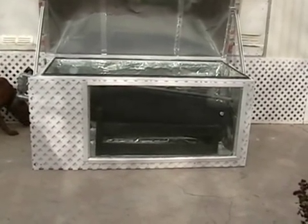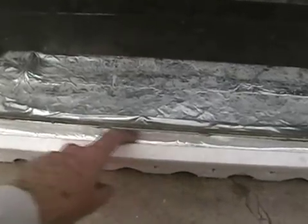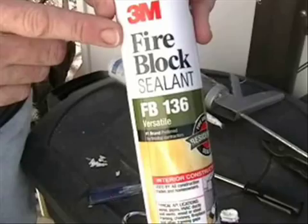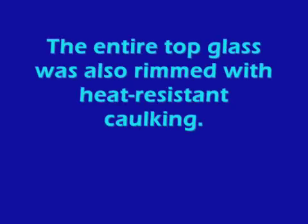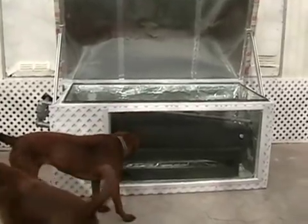Here's the solar water breadbox with the new addition. Because of the winter low sun, I installed a front window so it can catch more sun, and framed it out with what I had available — some skirting edging and a little bit of roof edging right here. I also seamed off the edges with some HVAC aluminum tape inside and outside, and underneath I put heat-resistant silicone. Now you can see the tank right through the glass, so it's getting sun from this angle here and this angle here on top, and the roof is reflecting sun too.